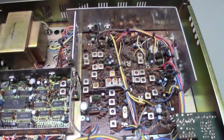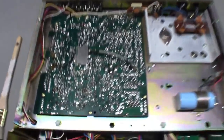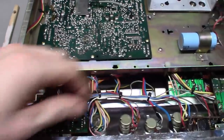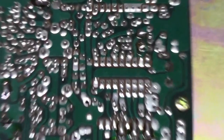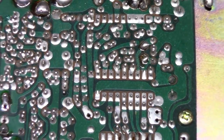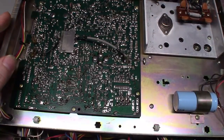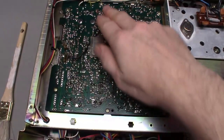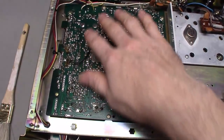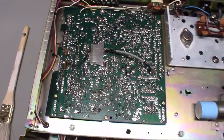Taking a look at the bottom side — also no modifications. The clarifier is still locked, no wires run for power, the PLL area looks like it left the factory with no cut traces, no hodge-podgery in the final section, no high-power splatter box mods. The only components bodged on the bottom of the board are factory — those two diodes and that resistor. Looks all original, really nice radio in nice condition.